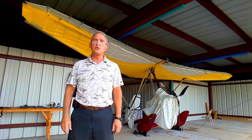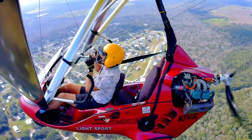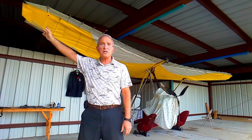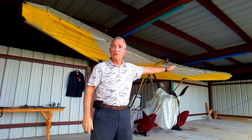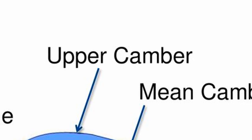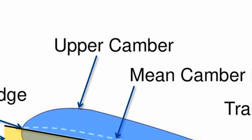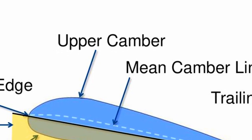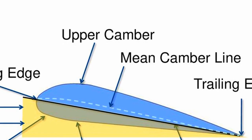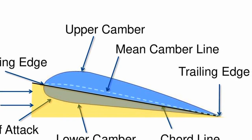It's almost always the result of the sail stretching. The goal is hands-off straight flight. What I did is I increased camber on this wing and made no changes to the other wing. See Bernoulli's Law: an increase in upper wing camber increases lift. Because as air speeds up, its pressure drops — thus lift increases. By increasing the upper camber height, the distance the air must travel over the top of the wing increases, thus the air's speed over the top must also increase, which creates more lift by the air's decreasing pressure.